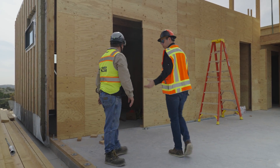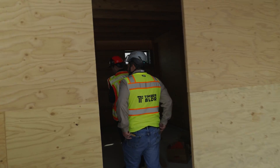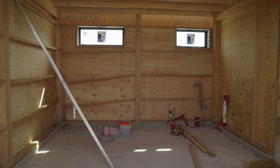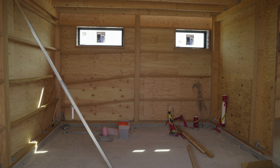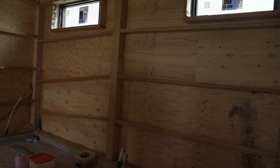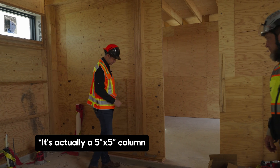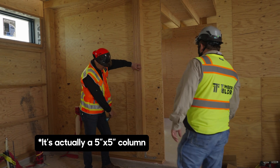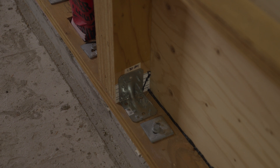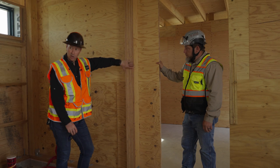There's really no traditional two-by interior framing. It's still the same system: on some interior walls we've got that same inch and a half plywood being used, same type of column. This is an all-plywood column — looks to be about four by six-ish. And you'll also notice he's using regular Simpson hold down hardware, nothing super custom fabricated, nothing special — right out of the Simpson catalog. The engineer helped us spec all those.